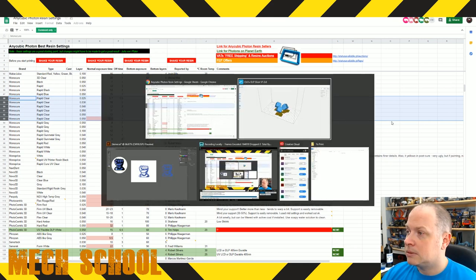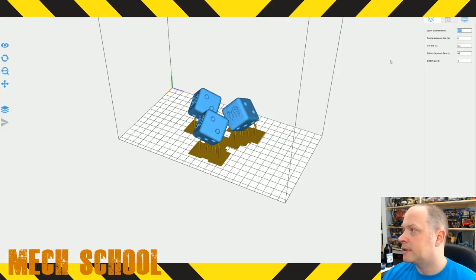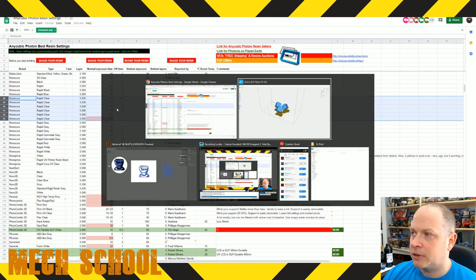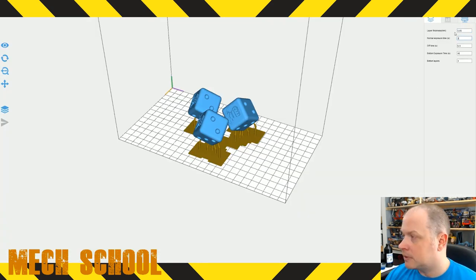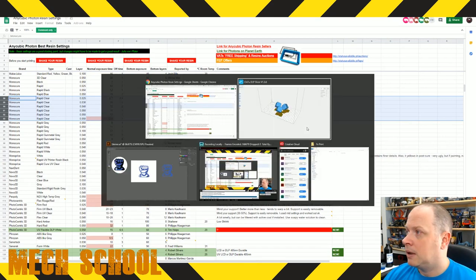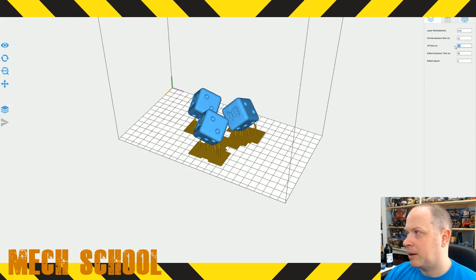So let's bring up this thing. 0.05. It's already in there. Normal exposure time. On here, these guys have it for anywhere from 7 to 12.5. Here's an 18. I'm going to go kind of in the middle and probably just stick with the 12. A couple of people have done 12 and been successful. So we'll go 12. Off time is going to be 6.5. That's the default for the printer. I could put a 50 in here, I could put a 1 in here. It wouldn't change how long it takes it to print. What it will do is affect the estimate on how long the print's going to take once I do the slice.